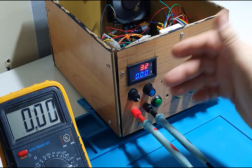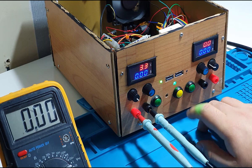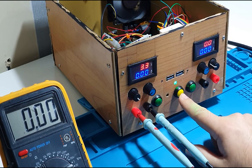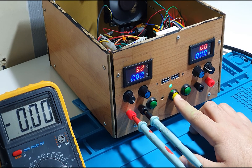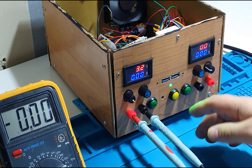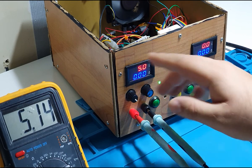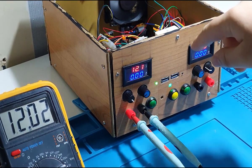It changes to 12V. After 2 to 3 seconds, the power supply turns on. If I press the button twice, power supply output 1 turns on. If I press once, power supply output 2 turns on, and pressing again turns it off. So we now have no voltage in hold mode. I click once — the LED turns on, and we have output voltage. That's the safety feature in action. I don't turn off the output before changing to 5V, and you can see there's a 1-second delay when switching — that's the relay transition time.